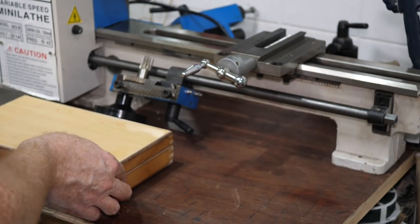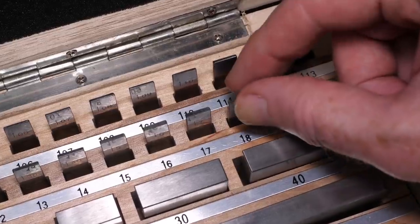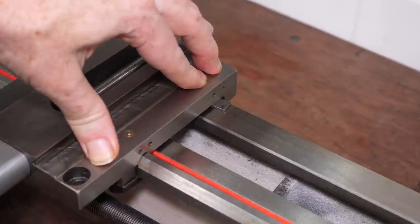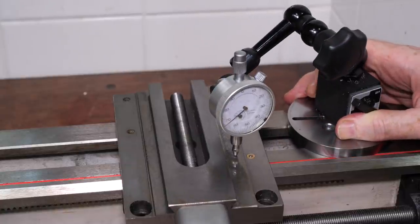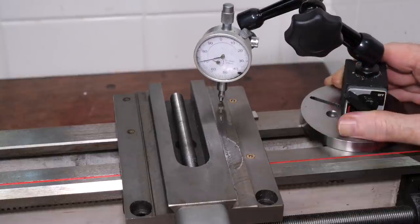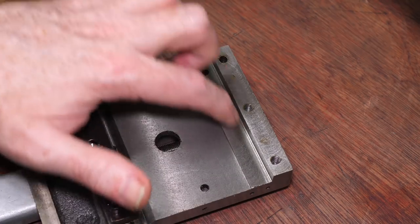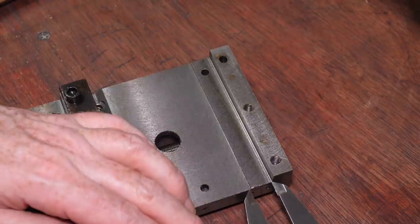This is exactly the kind of measurement that gauge blocks are good for. I know the back was about 1.8mm lower, so I'll start with something close to that — the gauge block set has a 1.8mm block. The gauge block fits neatly underneath the saddle and seems stable even though the back is now only supported at this single point. It's now much more obvious that there's a higher area in the middle of the slide, but the end points where it contacts the bed are now around the same level. Looking at the underside of the saddle, this rectangular area is clearly intended to rest on the bed, though at the moment only the rear edge makes contact. The most straightforward fix seems likely to be to attach some shim stock to this area. The area is about 100mm by 10mm wide, so I'll note that for reference.